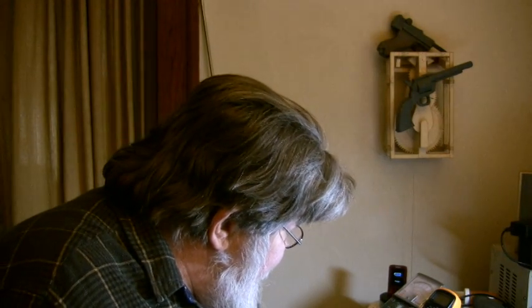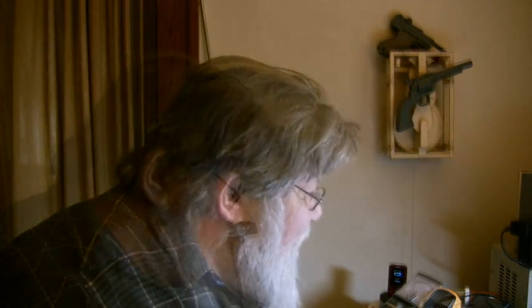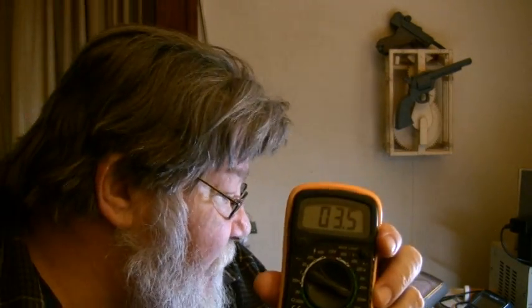It says we should be less than 10 milliamps, so let's do that. I switched meters because I think my other one's batteries are going bad. I set this meter to the low reading and I'm getting 3.6 milliamps, which is below 10 and on the lowest setting, so that should be good. We pass that part.